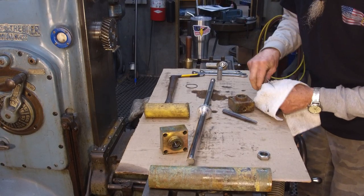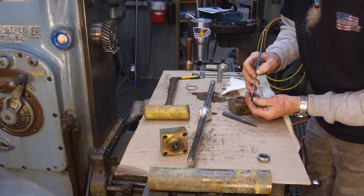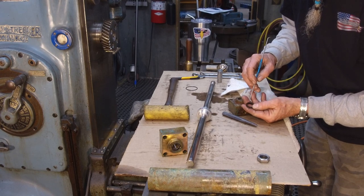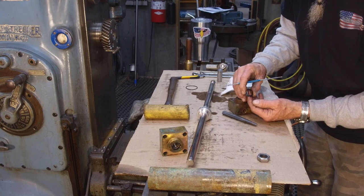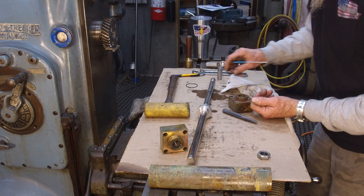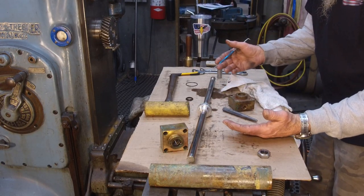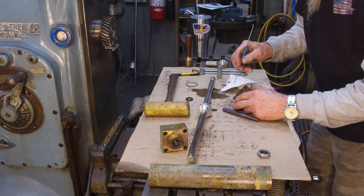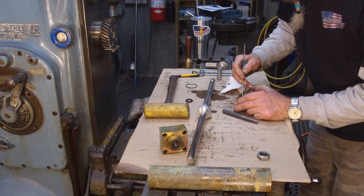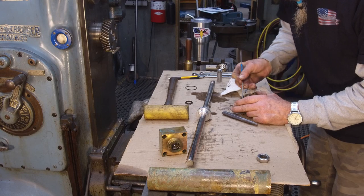Main thing on the wiper is the cross section here, the rod diameter, and the OD. And of course you have a couple different materials that you can choose for that as well. We're not really working with any high-tech fluids, so we're not going to be vulnerable to anything oddball in this situation. Some of the things we used in the yards in the old days.